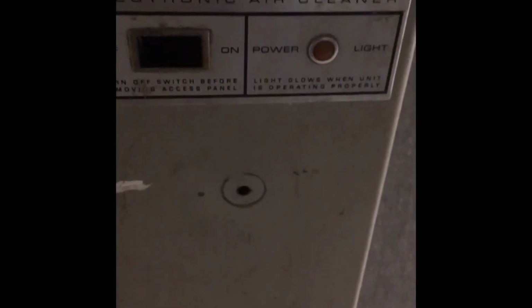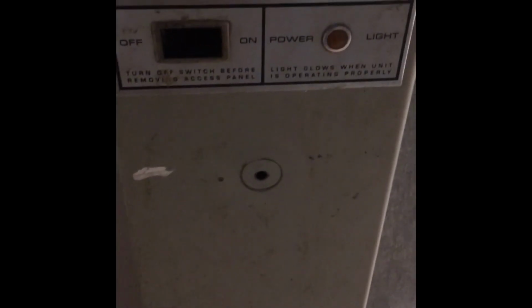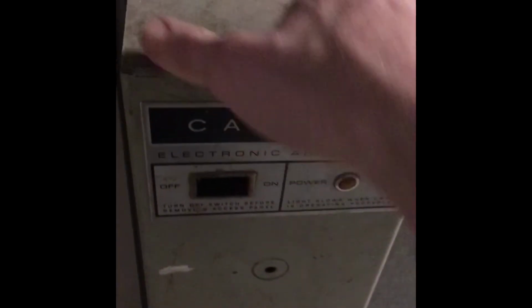Well, did some looking around, as you can tell. You won't hear that noise anymore. And that's because my unit used to have one of those, I think they're the electronic air cleaner, there it is, a carrier. Anyways, since the electrical part isn't hooked up anymore, I found out the person that lived here had shoved air cleaners into the returns where I just showed you.